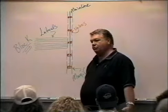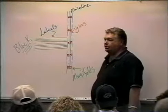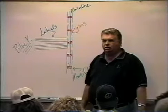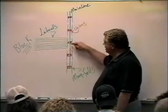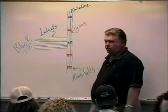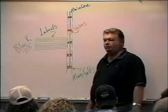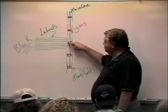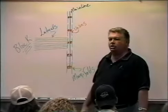The manifold doesn't have to be as big a pipe as the main line, because the most flow in any direction in the manifold is half of what's coming in from the main line. The manifold can be smaller, and I can also downsize because I'm starting to lose water as I go out with my laterals. As I drop off laterals I reduce the total volume of water in the manifold, so I could use smaller pipe at the end and bigger pipe toward the valve. That's very common.